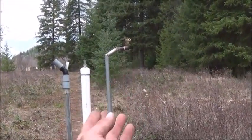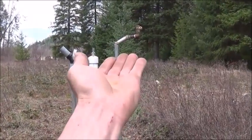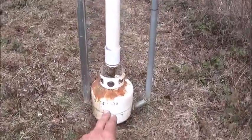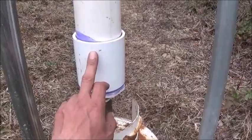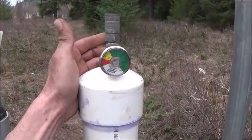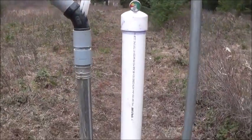When it gets to the top it's going to start generating enough speed, and then — like the water ram — it's going to slap that one-way valve at the top closed and generate the water hammer effect inside the system. All the compressed air down here in the lower propane tank, when that happens, will get rammed up into the storage tank. This tank lets us read our pressure with a gauge here, and we've got a standard air compressor style fitting out of the top so we can put that air to anything we want.